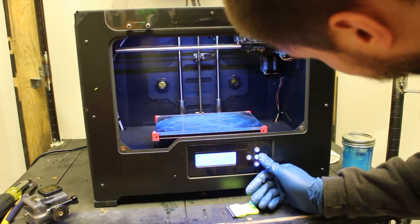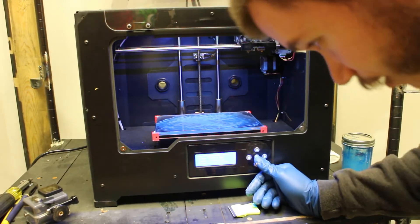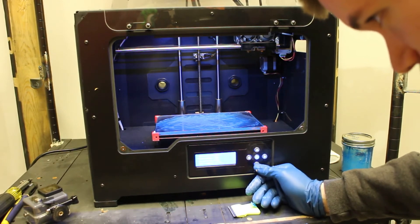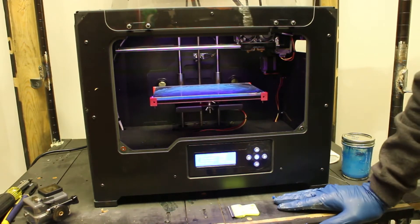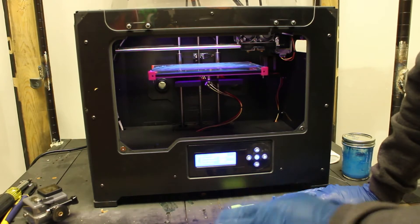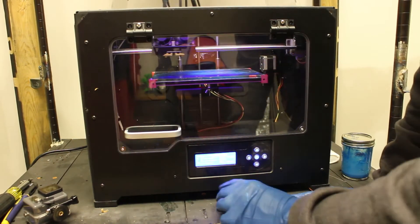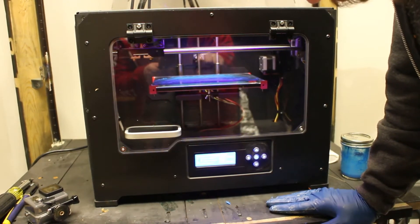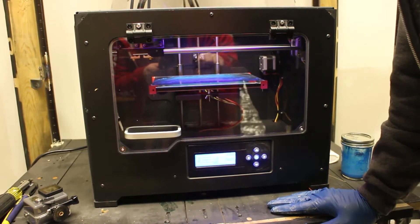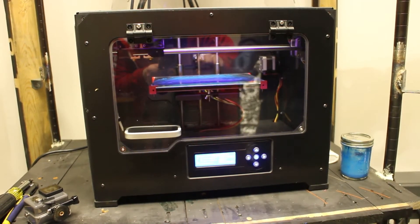Now we are ready to rock. We have our filament loaded, everything is up to temperature, and the bed is covered. We're going to print from SD - a cool little hexagonal vase. The printer is pretty decent. The one thing I hate is the software - it doesn't use a standard slicer like most open-source 3D printers. It's basically a rip-off of the MakerBot and uses Replicator G, which doesn't like large files. Now we're heating up to 90 degrees Celsius - we'll switch to a time-lapse.